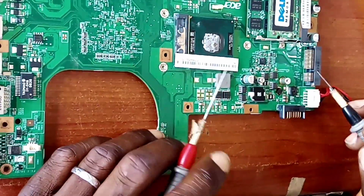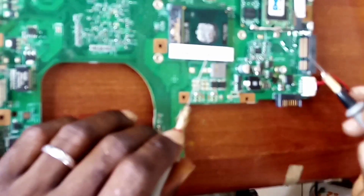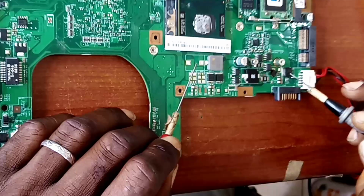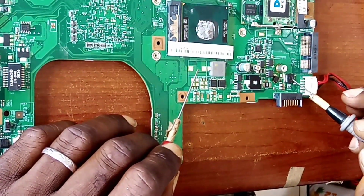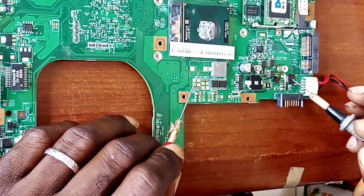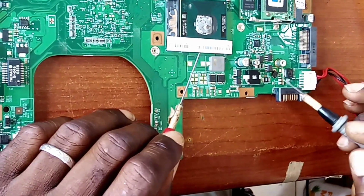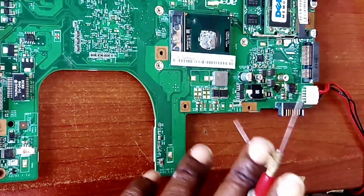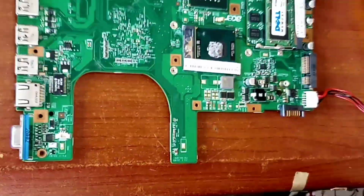It's actually meant to protect the board from the voltage from the input side, which would probably have damaged the MOSFET, the first MOSFET, the landing MOSFET on the board. Without this diode, this MOSFET can never be protected. So for the fact that we can't find this diode at the moment, the board can still be powered and it will come on. Let's just give that a trial.